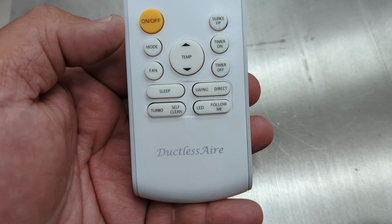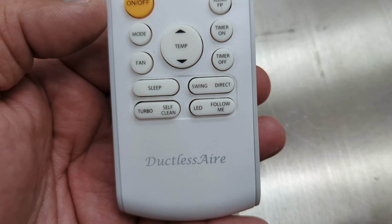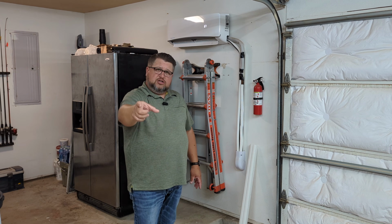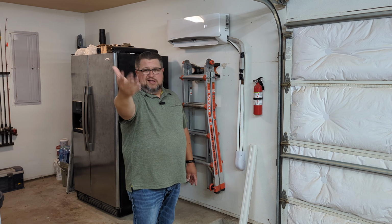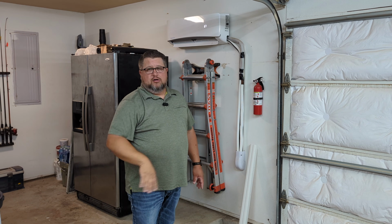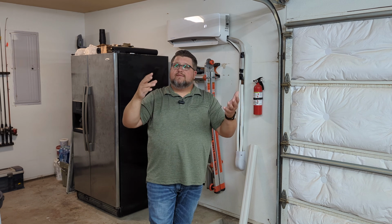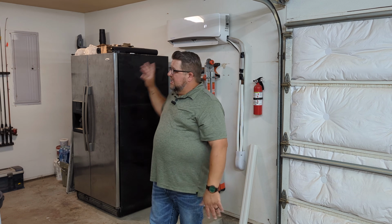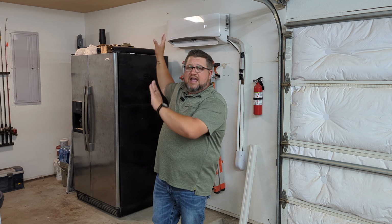So I just hit that follow me button on the remote control, and what it does is it uses the remote control as the thermostat. So wherever it's sitting, it determines, okay, this is where I'm taking the temp down. And so I just set it right out here somewhere, and I've got it mounted on the wall. That helps me control the temp and get everything down in here to the temp that I need it to be, rather than it getting cool in just this alcove area and then shutting down.